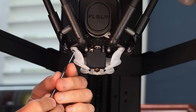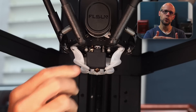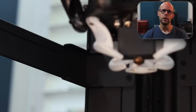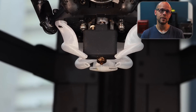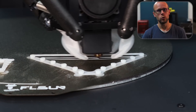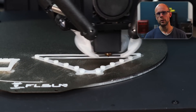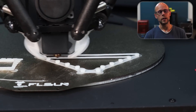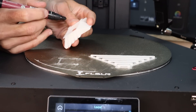Last is the Sentinel. This one has the addition of a sort of auxiliary fan at the back, set a little further from the nozzle and a little slimmer and narrower. Along with that I have four ducts which are not pointed directly at the nozzle but rather slightly off-center. The hope is that it places cool air around the nozzle without cooling the nozzle too much, while the extra back fan helps cool the entire part to prepare for the next layer. Even though it looks bulky, it's still well below the stock duct in weight. I also ran a test by taping off the rear blower and using it as a four-duct version to see if that had any impact.